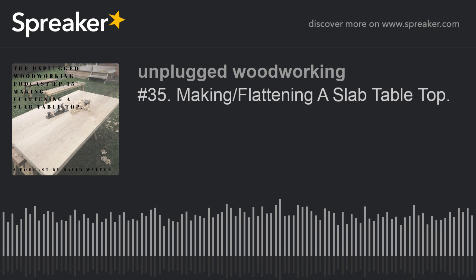As I've just said, I started off with two slabs. These slabs were just over 2 inches. I can't remember the exact measurement, but they were ever so slightly over 2 inches. There was bad cupping in them. I say bad cupping, it kind of wasn't bad cupping. In my experience, what I tend to find when I get slabs of oak, I do always tend to get the cupping in them when they've come out of the kiln. It's very common, and I see a lot of this. So even before I bought the slabs, I had in my head that I was going to end up with two slabs that were going to be cupped.